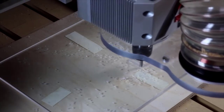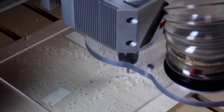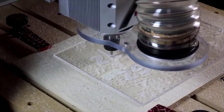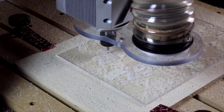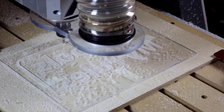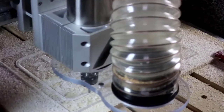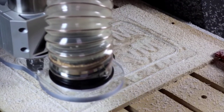The quarter-inch polycarbonate is being cut with a quarter-inch single-flute bit. The image has been reversed and is being cut into what will be the backside of the polycarbonate — a common approach for see-through materials. Dust collection on these CNC machines is great when the dust shroud is on. With double-face tape holding the polycarbonate in place, I'm cutting completely through with no tabs to produce the final outside shape.